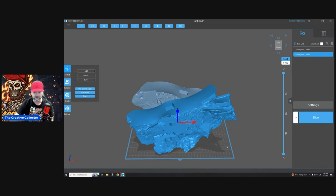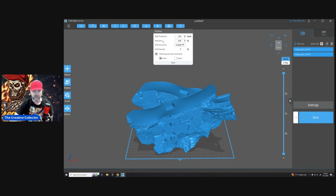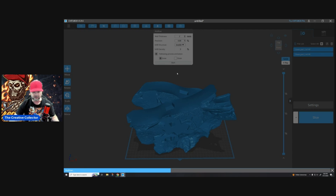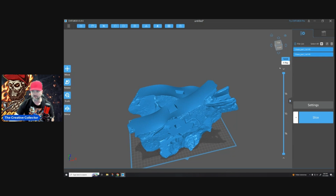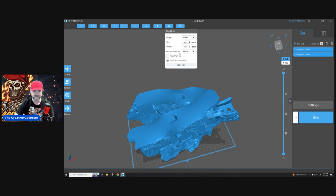I'll show you exactly what it'll look like on your build plate. We're going to go ahead and hollow these out — I hollow my stuff out fairly thin. For bases, I generally go just two millimeters and I use a 3D grid infill. So we're off to the races starting to hollow it out. Now we've got everything hollowed out and we're ready to go ahead and put our drain holes in.